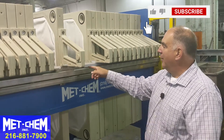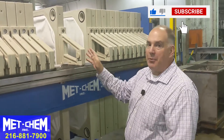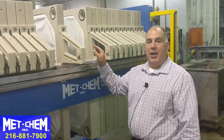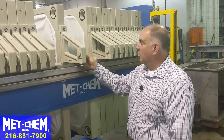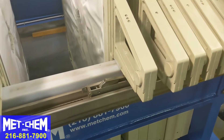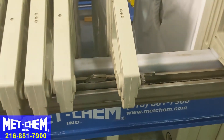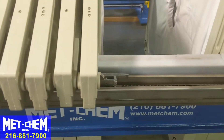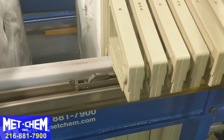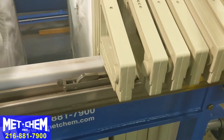This is the carriage. It will automatically come over and grab a plate. We stopped at mid-shift so you can see what's happening. The hydraulics are load sensing, so when the carriage comes over and bottoms out on the plate, it grabs it, pulls it back, and goes all the way to the end until the hydraulics sense a load and then reverse. It goes back to get the next plate and will automatically keep shifting until all the plates are done.